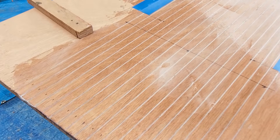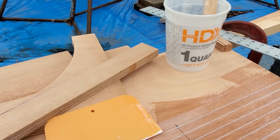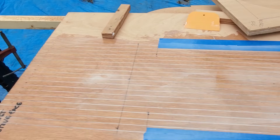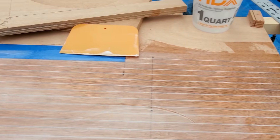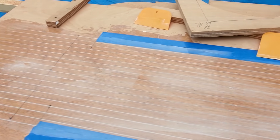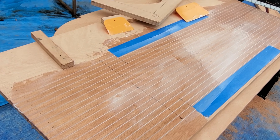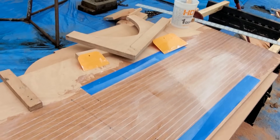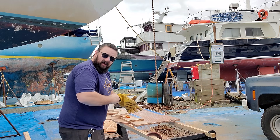Here we are — that was five pumps of epoxy each time. Coming out of the smaller can I did ten pumps, so we've got really good coverage on that. I've smushed it down into the kerfs and you can tell it's absorbed a lot of the epoxy just from the sheer volume put in there. Pretty happy with that — let's go ahead and get these boards attached with the c-clamps and get her bent up.